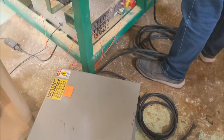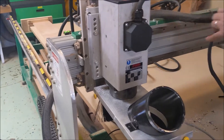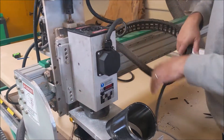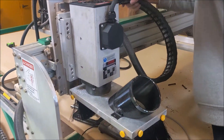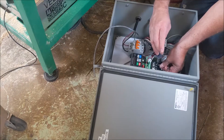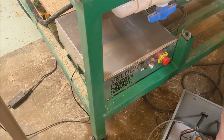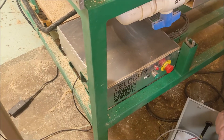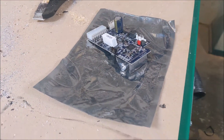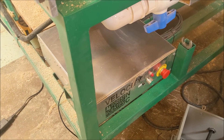And then this is the inverter here. The new spindle's installed, pulling the wire through the track. There's the inverter. A little more electrical. And originally the Porter Cable router was only on/off, so we have to add a small circuit board that'll convert analog to digital so that we have variable speed on the new spindle.